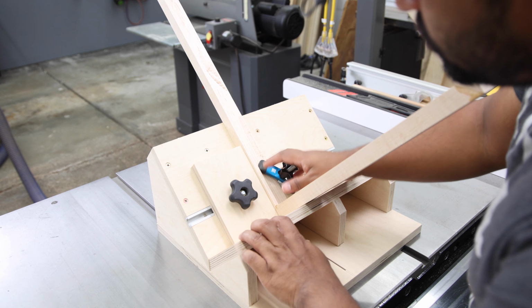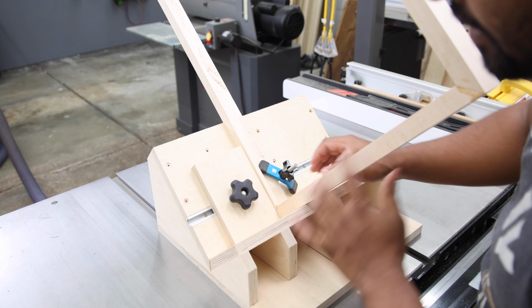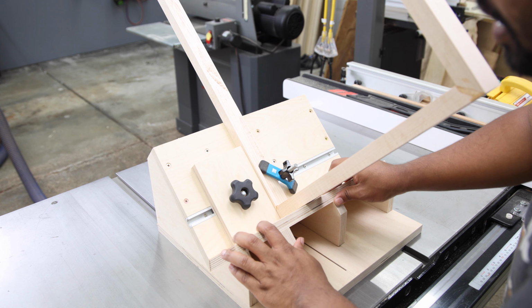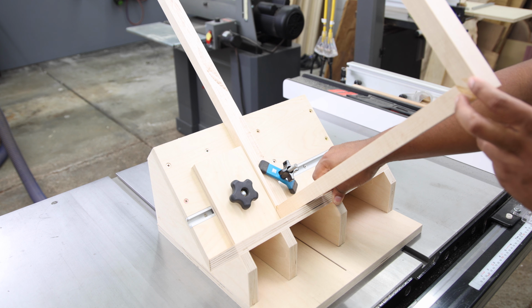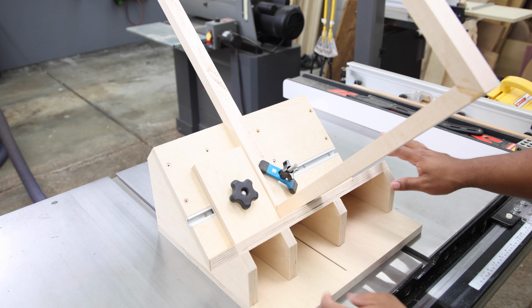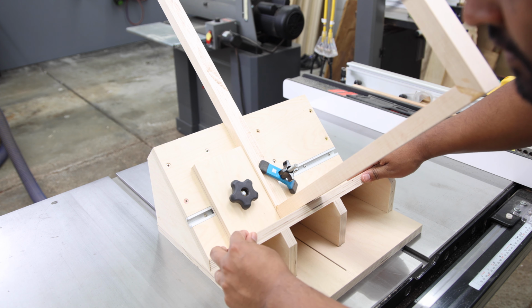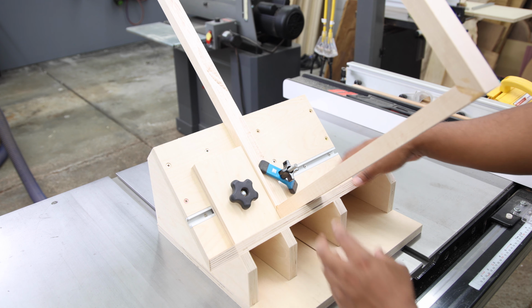Alright, so after the glue has dried overnight, I decided to take off all of the spring clamps and I mounted the picture frame on this miter spline jig. So whenever we do 45 degrees, that is an end grain to end grain joinery, we do need to reinforce it with something like a miter spline. If you're curious about this jig, I do have a build video on this particular project. I'll put the link in the description below. But for now, let's go ahead and take a couple of passes and get our miter splines cut.